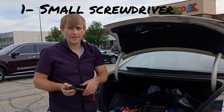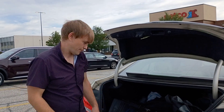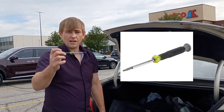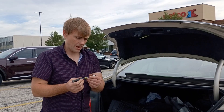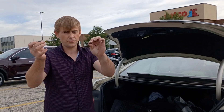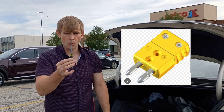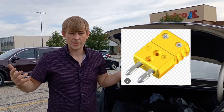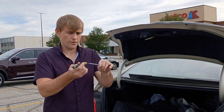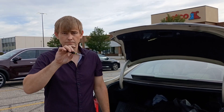The first tool I use is a small flathead screwdriver — generally an insulated small flathead, which is good for terminals and doing wiring work. This one right here is the Klein 4-in-1. It's a good option because you have a small flat blade for terminal strips. Flip that over and this little Phillips is perfect for thermocouple connectors. If you're doing instrumentation and calibrating thermocouples, that comes in handy. Pull that out and flip it over.